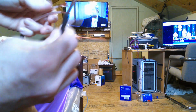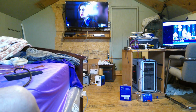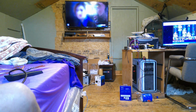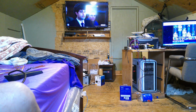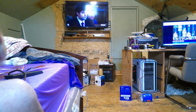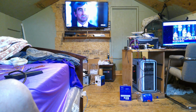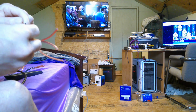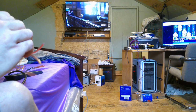And another thing you want to make sure when you're doing this, you bring copper to copper. I ain't saying you have to. You can use the chrome looking, whatever. But I would recommend, if you got the chance, put the copper to copper, then the two wire. The two metals ain't gonna interact with each other.